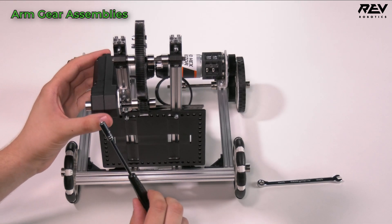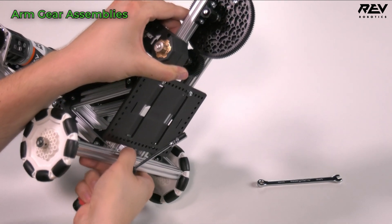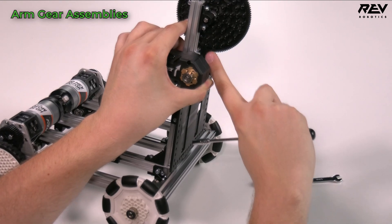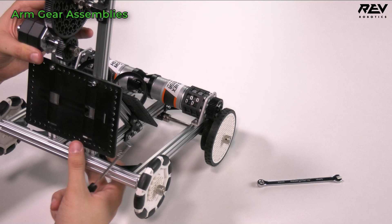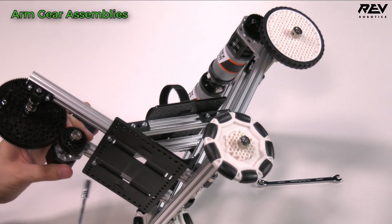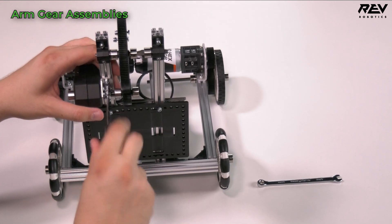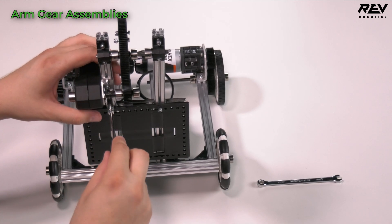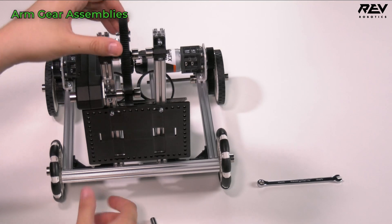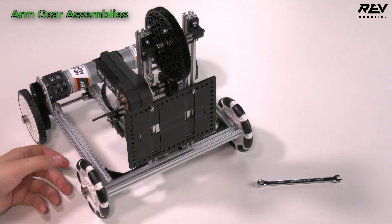Taking my nut driver and the hex core motor, I'm going to bring it up and mesh these together. This gear mesh is very important — it can be a little difficult to see on camera, but we're going to get this mesh such that the gears are flush with each other and well engaged, but not forced. Once it's in a good spot, we tighten the hex core motor mounting nuts so these nylocs get snugged up with the gear in good mesh. It doesn't have to be perfect, but we want it as good as we can get. Now we can see pretty good mesh, and it's got a lot of reduction behind it. We're ready for attaching the arm.